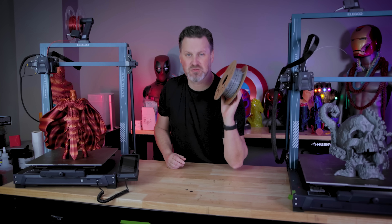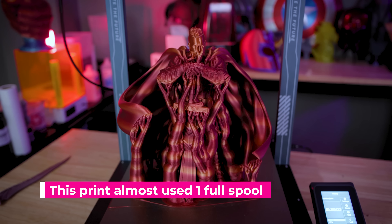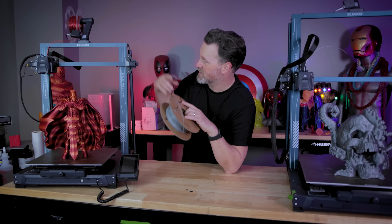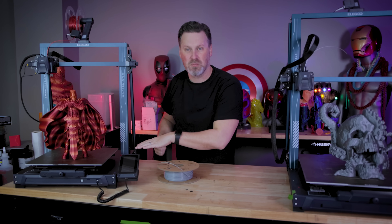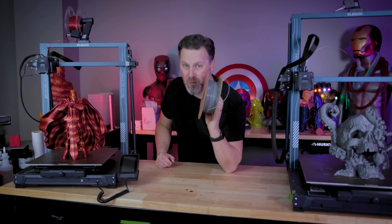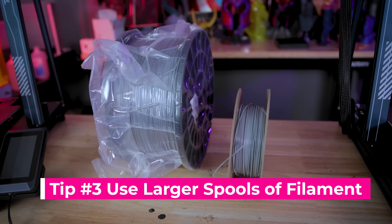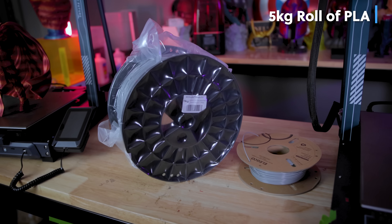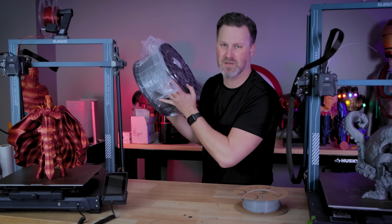The last tip has to deal with the actual filament you're going to be using when printing larger things. The bigger the printer, the more likely you're printing larger items, and the more filament you're going to need. The issue I've run into time and time again is I do not want to run out of filament mid-print and have to swap things out — even when printers like the Neptune 3 Plus and the Neptune 3 Max have auto-print resume and filament run-out detection. So what I've been doing is using these huge spools of filament from Ziltex and other manufacturers — a massive spool that you connect to your 3D printer. The challenge with these really large spools is getting them to reliably spin and feed into your 3D printer, and you obviously can't top-mount them since they weigh about 10 pounds.